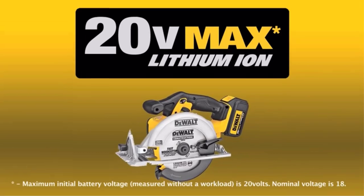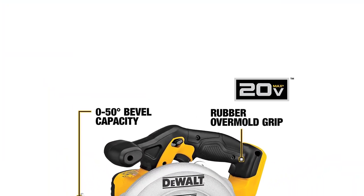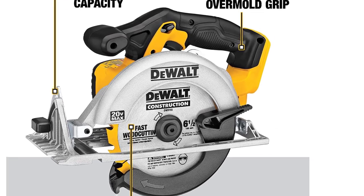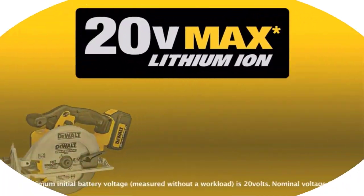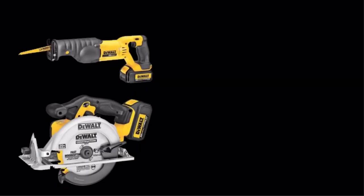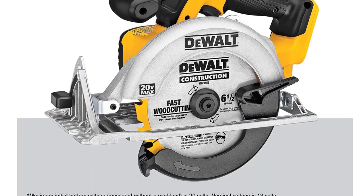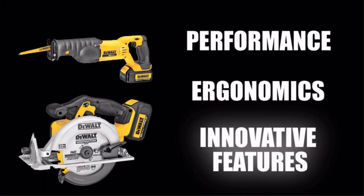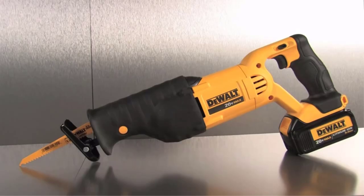The DCS391B is a sidewinder saw, so it's suitable for small to medium scale projects and for those who don't want a bulky tool. It has an electric brake that stops almost instantly, making blade changes convenient and safe. Since it is cordless, it's great for home or backyard projects and mobility. It has a 2⅛-inch depth of cut at 90 degrees, 1⅝ inches at 45 degrees, and it weighs 7 pounds. If you own any of DeWalt's 20V Max set of tools, it's easy to interchange the batteries with this unit.